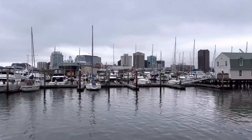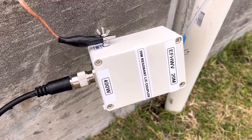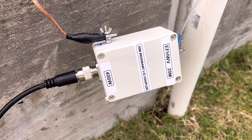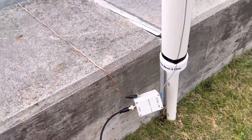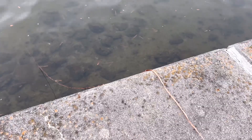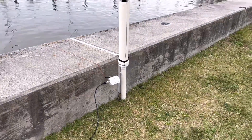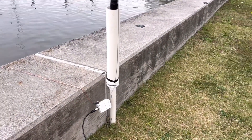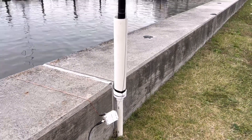Here's the setup today. There is the resonant coupler — that is not a 49 to 1. That is a coupler that has been balanced for a half wave on 20 meters. There's my counterpoise, the one singular counterpoise. This is about a 6 millimeter wide pure copper grounding strap that I got right into the water there. You can see it's low tide, so we're on the upper part of the salt water here in the harbor.